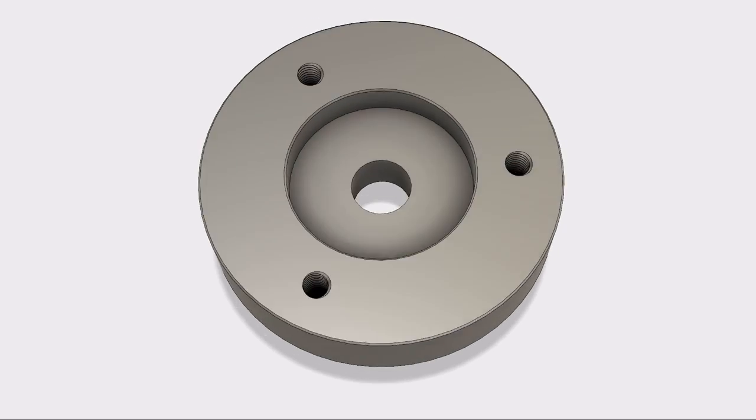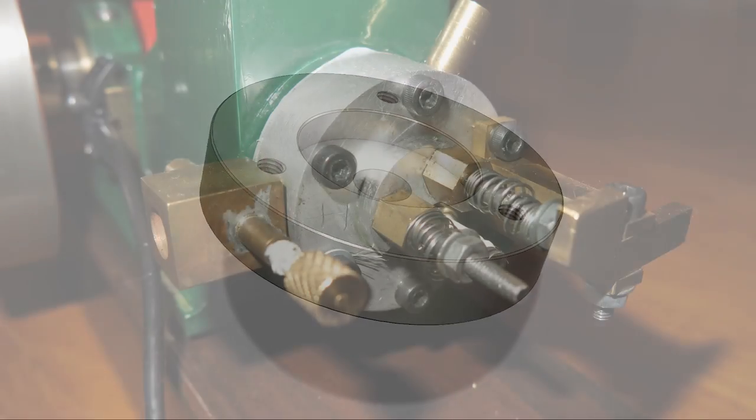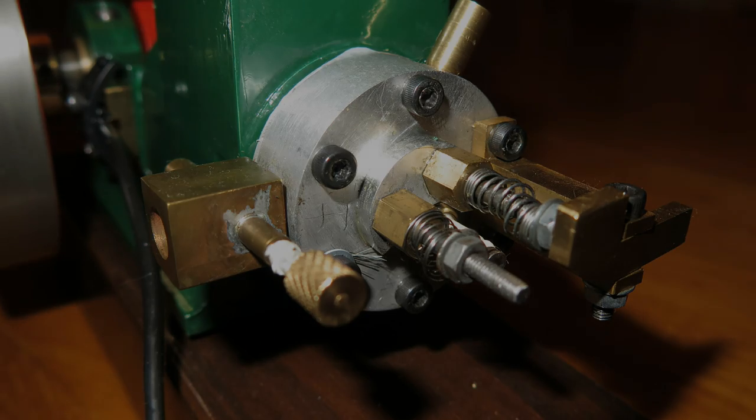You can see the profile of the backplate that I'm going to try and make in this animation. This is a picture of a cylinder head I made for a model engine. I've lost count of how many times it was transferred between the lathe and the rotary table, but each time I transferred it, I introduced a bit of error and I was never really happy with the part.